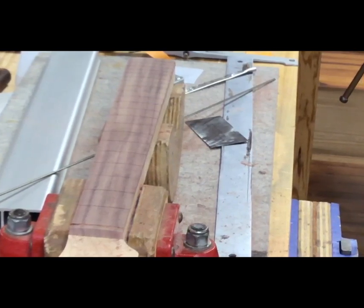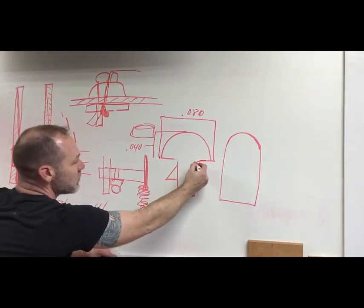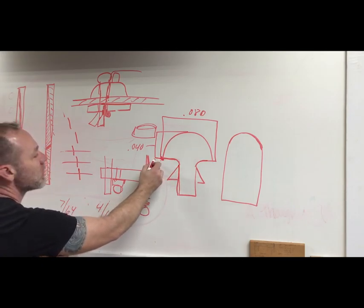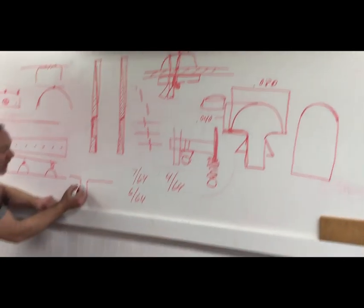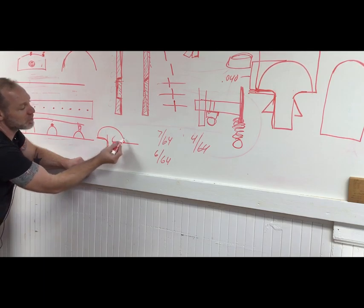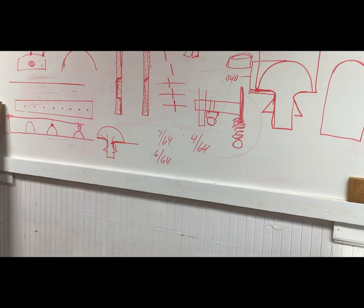The other thing it's going to do: we think frets look like a simple T-shape from the side, but what frets really are in the manufacturing process looks more like this — they have a little lip on the side. If the board is a really hard wood, that lip can keep the fret off the board. When the barb comes out, if that wood is elevated at the top, it'll cause it to chip out real bad. But if it's chamfered a little bit, it's got a little bit of meat there, supporting it from below. It helps prevent that — not always, but it does help.